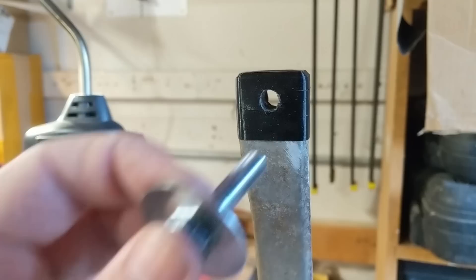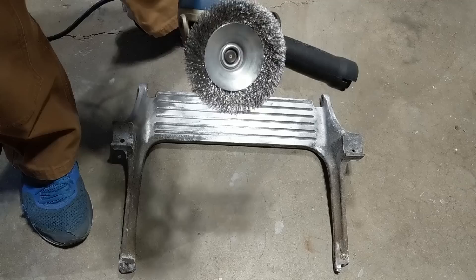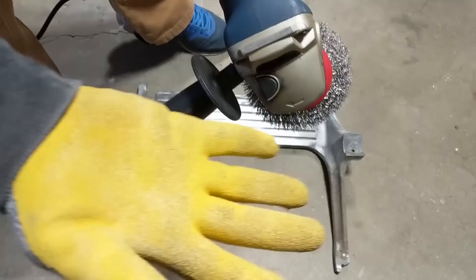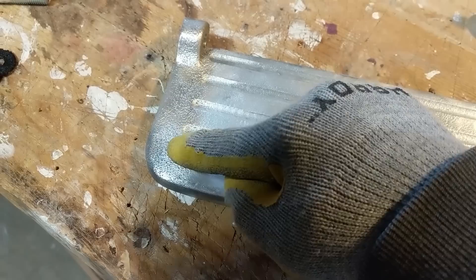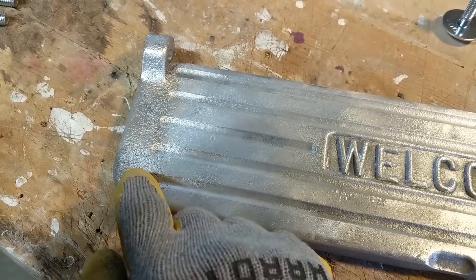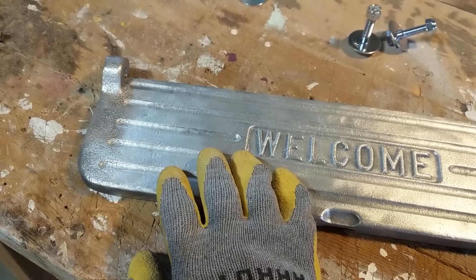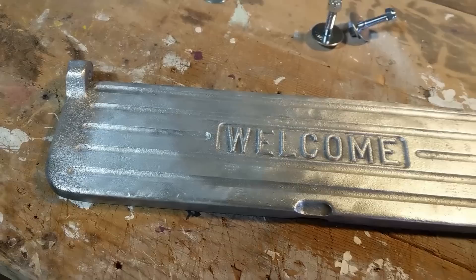That'll do. This wire wheel makes short work of polishing, but it sure does vibrate a lot — my hands are going numb. Now that it's all polished up, we can see just how severe the pitting is where this was in the bath. The acid bath went up to about there and that's where the pitting starts and stops. This is definitely not a technique if you need a nice smooth finish part — I can't imagine another situation where this pitting would be okay, except here on a step where it's actually going to add grip.